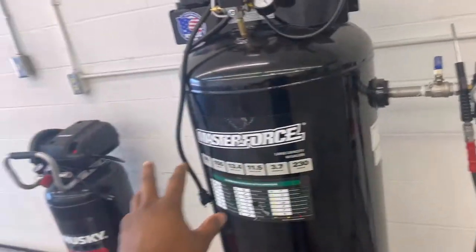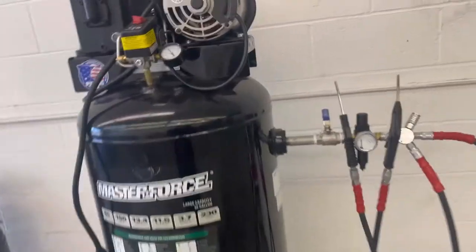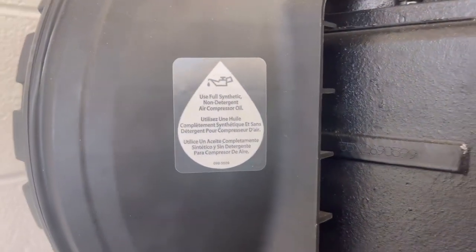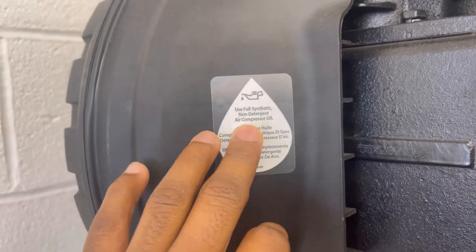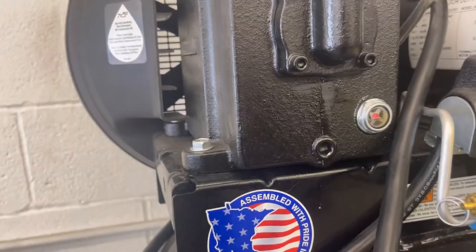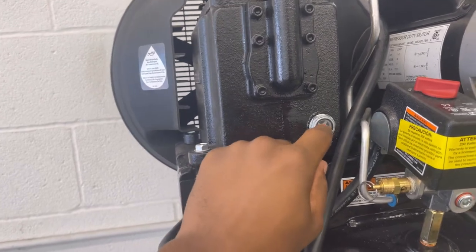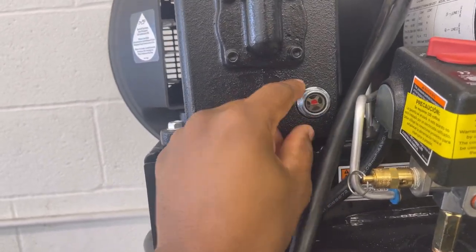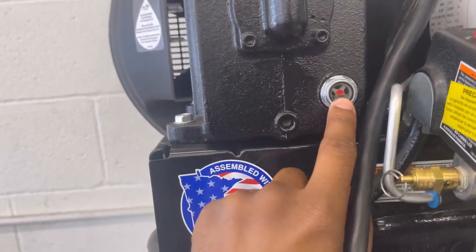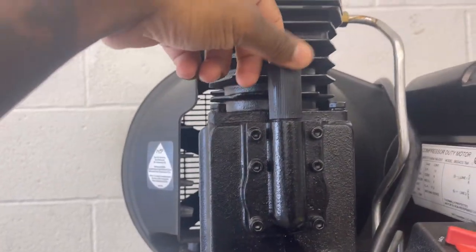So how it came — it was just the tank itself obviously on a pallet, and I had to buy all this extra stuff right here as you can see. So as we move up to here, you can see it takes full synthetic compressor oil. On the pamphlet though, it's pretty funky because it shows like a drain plug that you would use for oil. But actually this little indicator that you see right here is the actual drain plug. They want the oil to be kind of in the middle of the circle, as you can see right here. And then this is where you fill it up.